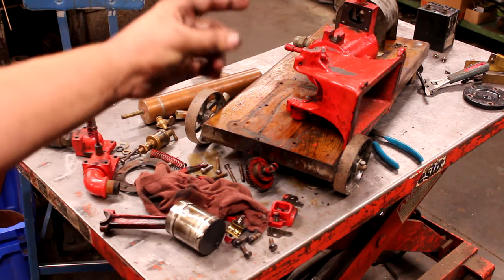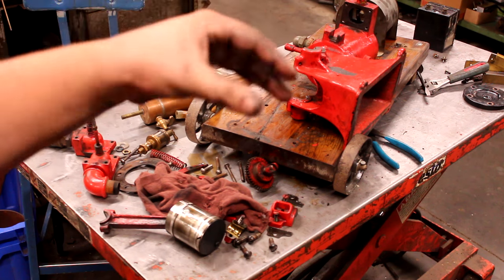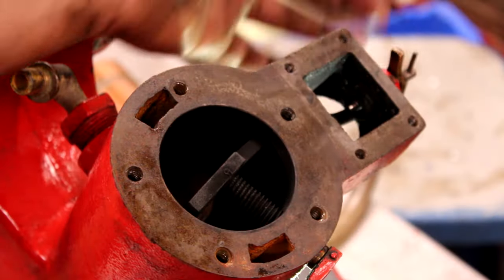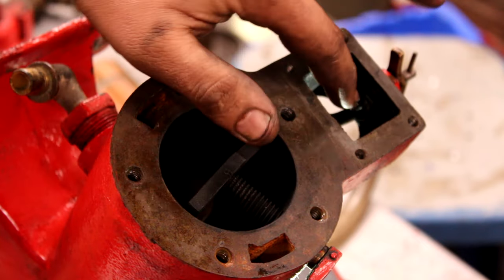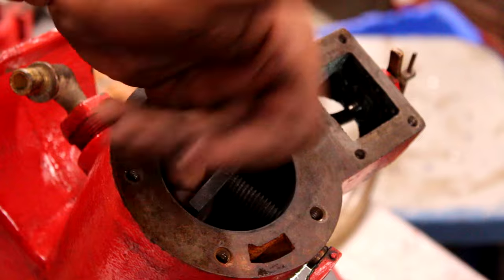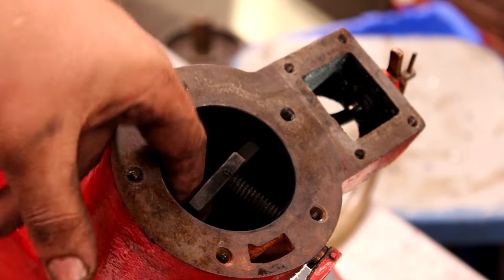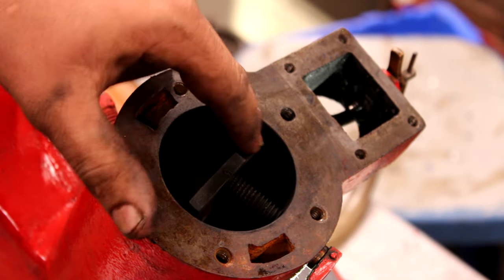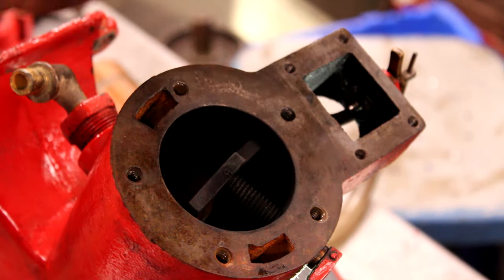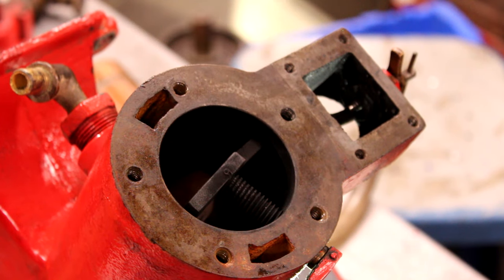On the top of the cylinder, you'll see that there's a rocker arm kind of sitting inside the combustion chamber, and that is your actual movable igniter shaft, and the piston comes up and lightly taps it, and that's what opens your points contact, which in this engine is on the valve chest, which you can see actuating here. And your stationary electrode just is bolted into your valve cage.